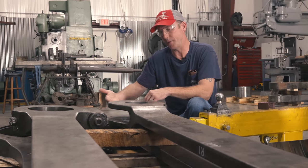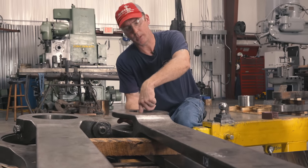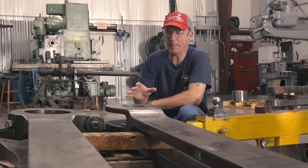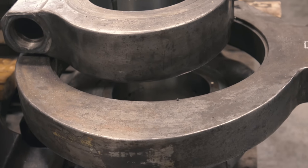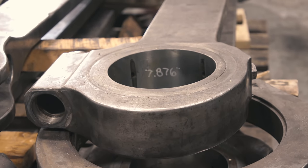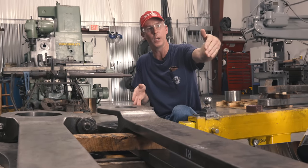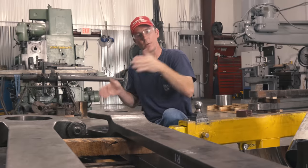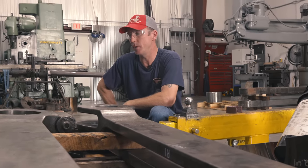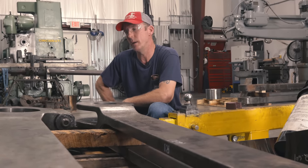The front end of the intermediate rod fits in here and the pin connects the two together. We checked the fits, made new bushings already pressed into the intermediate rods, as well as new floating bushings after the knuckle pins were trued and lapped in. Now the rods are all machined true and honed, center to center to center to center, so the spacing is correct. That's something we did here just to make sure this will be a good-riding, long-lasting locomotive.